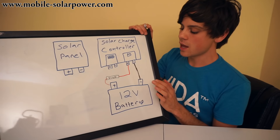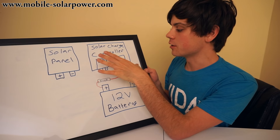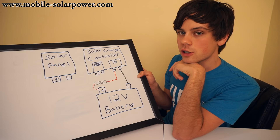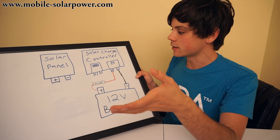This should be done before you connect the solar panel to the solar charge controller. When you do this, the solar charge controller will have some lights or a screen and will say on, it will say that the battery is typically a good charge — a green light or something like that. That means you hooked these up correctly. If you put the positive on the negative and the negative on the positive, you can destroy the solar charge controller. So it is very, very important to get this right the first time. Once the solar charge controller registers and shows a green light, you can connect the solar panel to the solar charge controller.